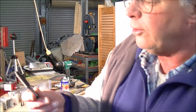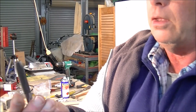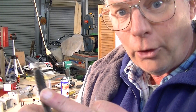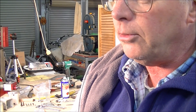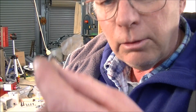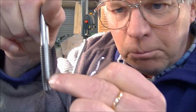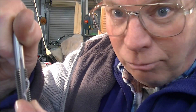Let's get a big tap so you can see what's going on here. So when you're putting this into the hole, each one of these threads is gouging a slot — not a tapered slot, it's a spiralled slot, because that's what a thread is. And as this is cutting its way down into the aluminium, you have swarf that it's cutting out that builds up in the middle here, in this gap, and it's really got nowhere to go.